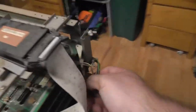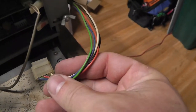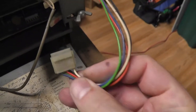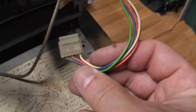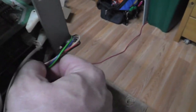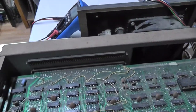The video connector goes right there and it's almost like a Nintendo cable, but I don't know if it's the same pin-out. It's sync, then skips a pin, then ground, red, green, blue. I might have to check my Nintendo cable to see if it's the same. The other side has a little weird plug so I'd have to rig something up.